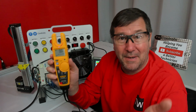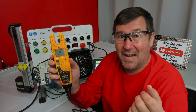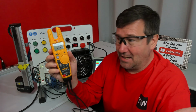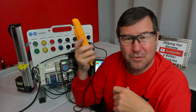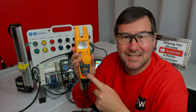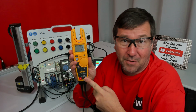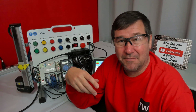The other thing is measuring milliamp signals such as 4 to 20 milliamps. It won't do that. But I do a lot more voltage and ohm measurements than I do milliamp measurements. So for your go-to grab a meter and check something out, I think this T6-1000 is a well-rounded meter. If it comes to milliamps, I'm probably going to go with the 87V.